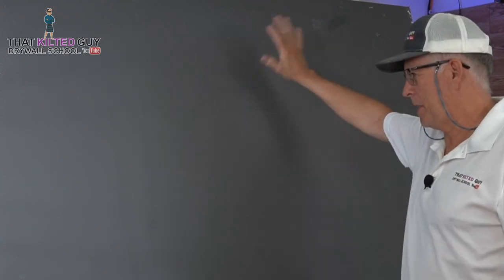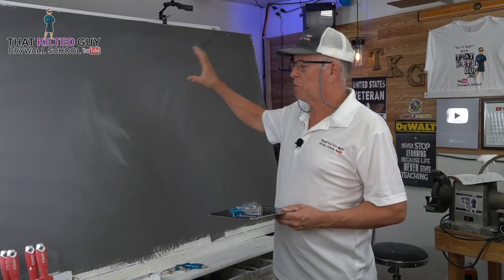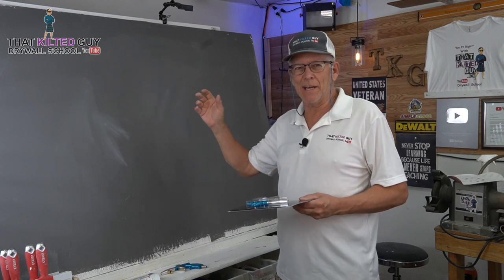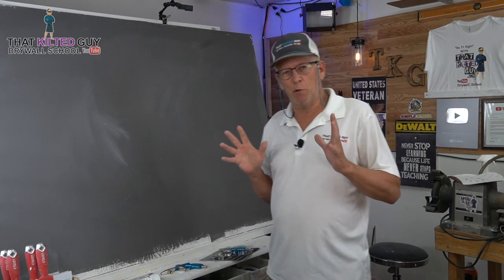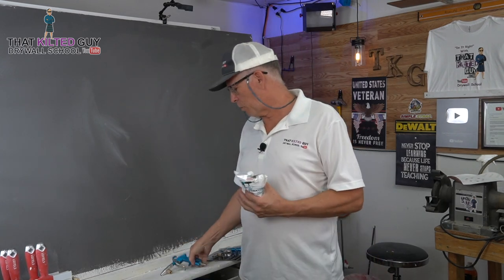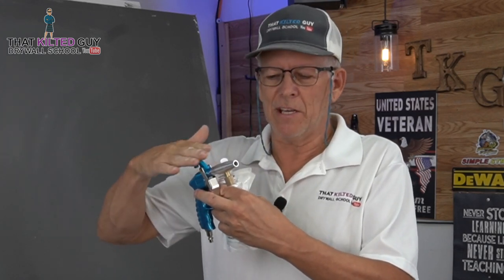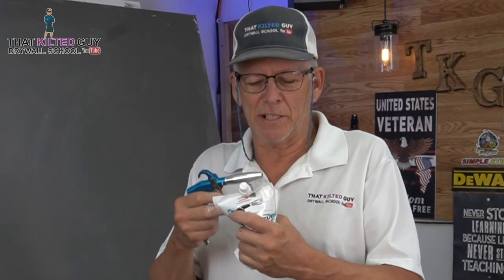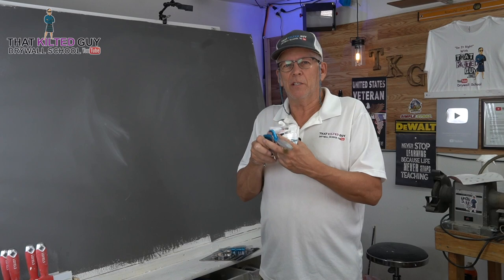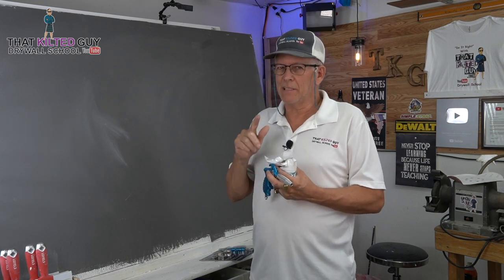I painted this sheetrock easel here a dark color so you'll be able to see the texture going on. We're going to spray two or three styles of orange peel and see if we can get various texture patterns, and then spray a little bit of knockdown. The way you control the texture pattern is how hard you squeeze on the gun. What it's doing is sucking texture up into the airstream — as the air goes through here it's creating a suction on this tube. It's not a real strong suction, so it doesn't just collapse the bag. But when you squeeze it, you start feeding material in. The lighter the texture, the less you squeeze it; the heavier the texture, the more you squeeze it.